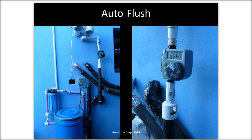And with this type of system, the homeowner or someone has to clean the filter once a month. And graywater filters are yucky. It's sort of like a sink trap. It's slimy, it's smelly, and you need to sponge this thing, squeeze out this spongy filter element. And it became something that people just weren't doing, or they do it the first month and never again. And once the filter clogs, the pump can't pump through, the pump burns out, and they've lost a $350 pump, and the whole thing becomes kind of annoying and problematic.